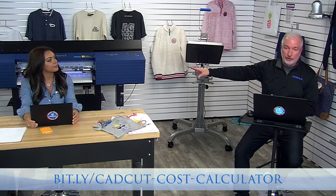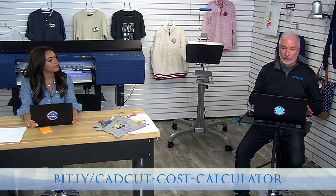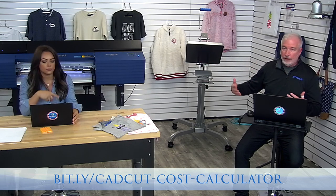There's a way to find the exact cost with a cost calculator that breaks down what your ink is per square inch and per square foot. The ink is actually the cheapest part of those three numbers. We're down to like less than 19 cents a square foot — so a full 12 by 12 full bleed covered with ink was only about 19 cents. Divide that by 144 and the ink is such a small amount — there are a couple zeros past the right of the decimal. That's a surprise to many people. The ink does not make up a ton of that cost. In this printer, the way it distributes ink is very stingy — a little bit goes a long, long way. Most people buying 500 milliliter CMYK cartridges usually get at least nine months out of a set of ink under average use.